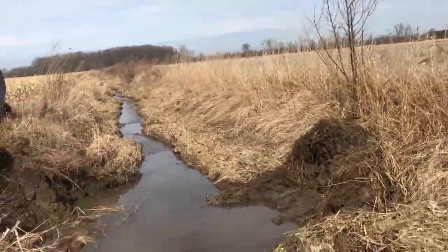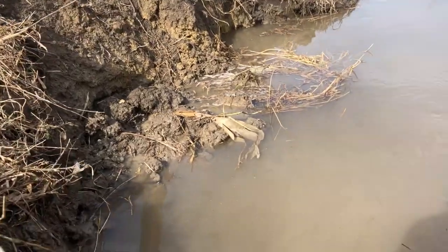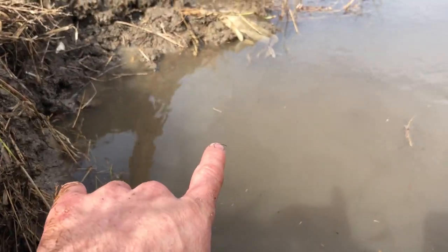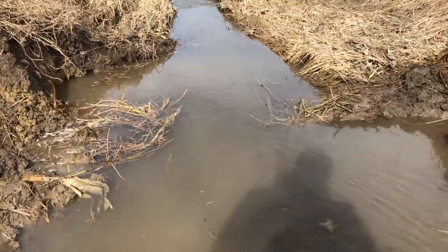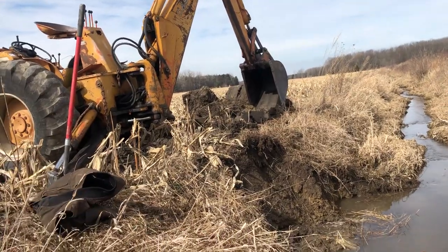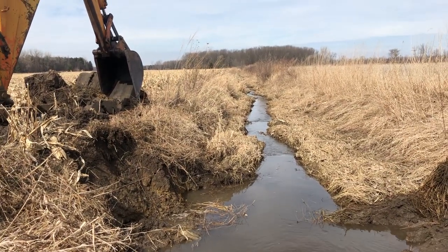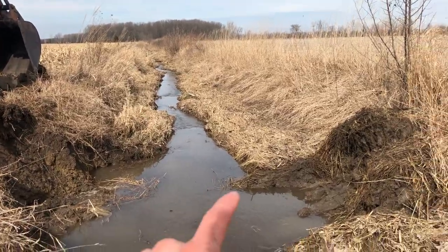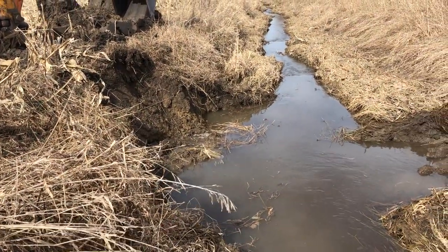I tried widening this area out to create a suction out of that tile. You can see the water pushing up out of that tile — it's about six or seven inches underneath there. In my mind, the ditch should be lower than where your tiles are, so your tile can constantly be dumping into the ditch without competing with the standing water. That tile is about six to eight inches under the water right now.